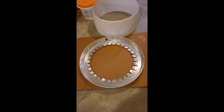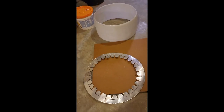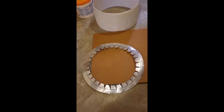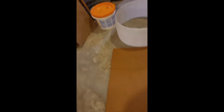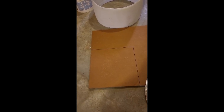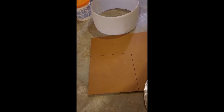Now the next thing is to cut the side off of the pan because I don't want it to collect water. The flange is cut out and it's going to serve its purpose. You can see that square marked on that piece of cardboard — that is the size of the door in the top of the septic tank, and the flange covers all the corners. So when I seal it down and screw it down, no surface water will be able to leak into the septic tank.